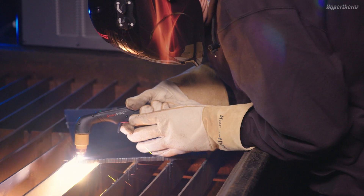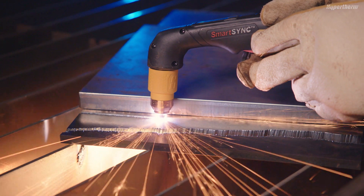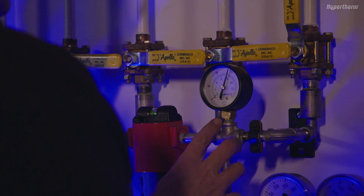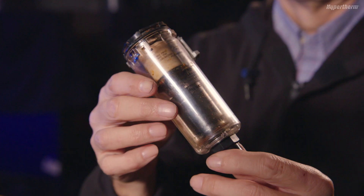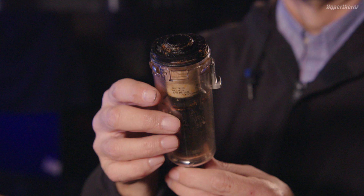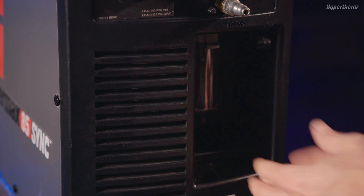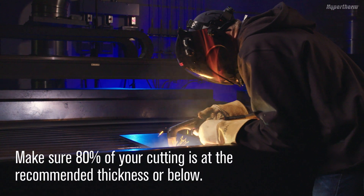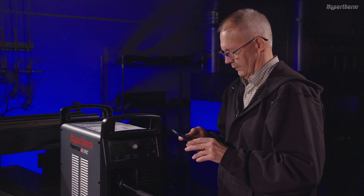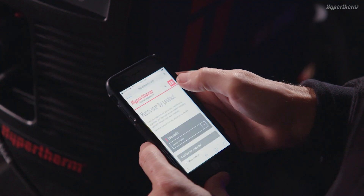Keep in mind that dirty or wet air can impact cartridge life. If your cartridges seem to be wearing prematurely, check the air pressure settings and inspect the air filter bowl and filter for contaminants. If dirty, replace the filter. Also, make sure that 80% of your cutting is at the recommended thickness or below. Severance cutting will wear the cartridge faster. Please refer to the recommended guidelines in the operator manual for best results.